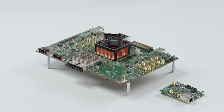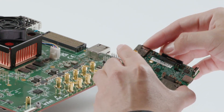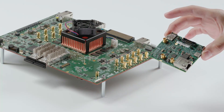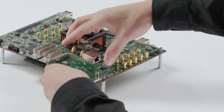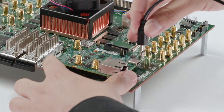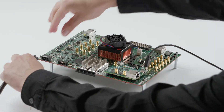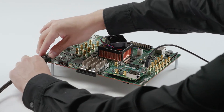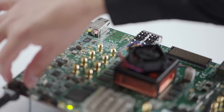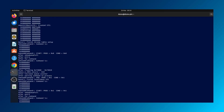Now let's connect the board and boot Linux on the HPS. First, let's insert the provided microSD card into the HPS expansion board. This microSD card is pre-loaded with all the firmware needed to load the golden system reference design. Now let's connect the HPS expansion board to the development kit. Plug in the mini-USB cable and connect to the host PC. Connect the power cable to the board and flip switch 2 to the on position. The HPS begins booting the golden system reference design Linux image.